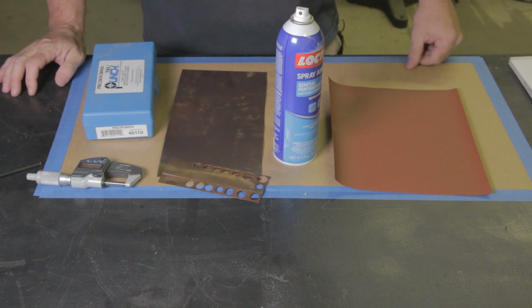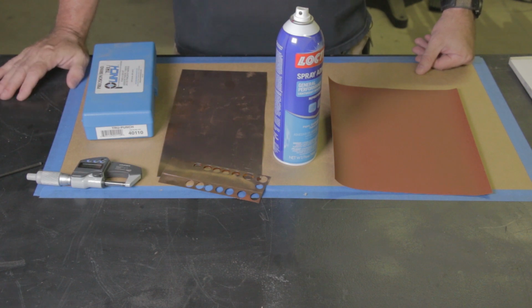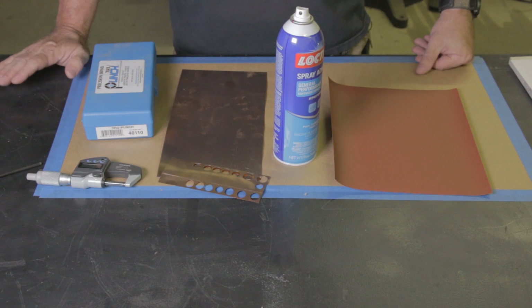Okay, so punching and lapping my own bronze washers, or more accurately, shims, came out of my quest for more accurate tolerances. By blueprinting each part on my knives, I can achieve accuracy tolerances of less than 1/1000th of an inch. All right, so we're just going to jump into this. There's no reason for this to be a very long video. I'm just going to start out by covering the tools and materials that I use, and then I'll show you how I punch, and I'll show you how I lap and measure.